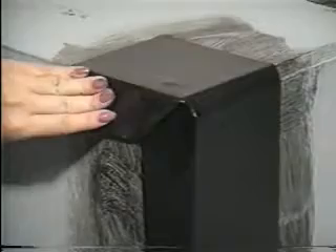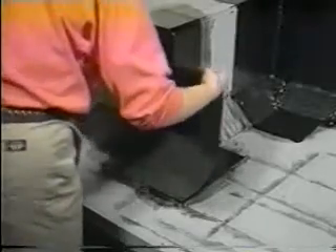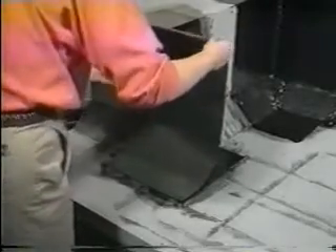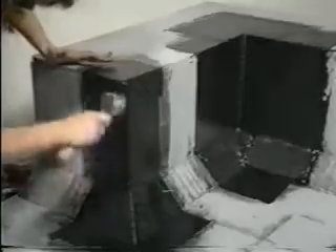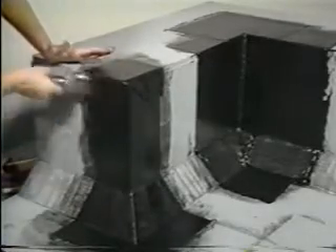Work the side up to make a pig's ear. Glue the pig's ear flap down, and since the corner has to be double wrapped, apply a second piece of flashing in the same manner as the first. When you are finished, check that all bridging is tight. Use lap caulking to caulk all seams.